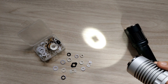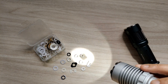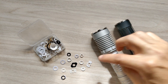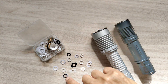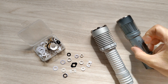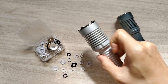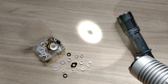I didn't give up — I want to make a flashlight with SFT70 and a smooth reflector. I tried many types of gaskets to achieve a perfect beam. I also tried darkening them, making them black — still not good. Finally, I found that the thickness of the gasket plays an important role.